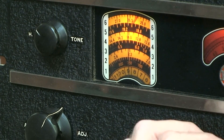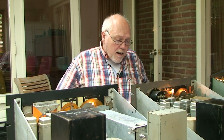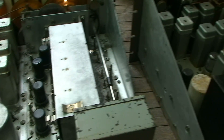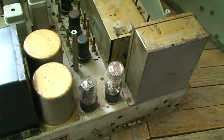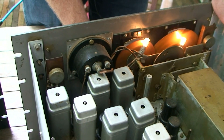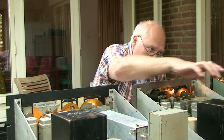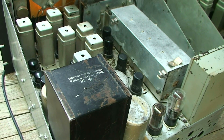One special thing about the quality of these receivers is the capacitors used. There are hardly any paper capacitors — and paper capacitors are usually the ones that go leaky and cause problems. Mica capacitors can cause problems but hardly ever; they are usually still okay. In these receivers there are no electrolytics either, which are also a common cause of problems — so no issue there. The main capacitors are oil-filled paper capacitors, and as long as they are not leaking oil, they are usually still fine.